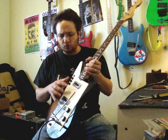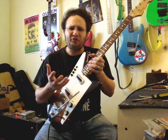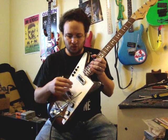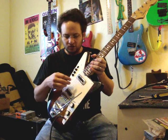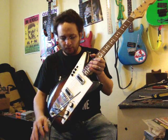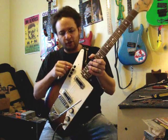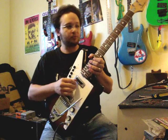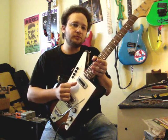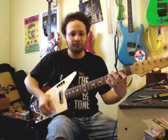2 single coil pickups that were originally wired to some high-pass filter that caused the bridge pickup to sound very out of phase with itself, very thin. Same thing with the neck pickup. So one of the things the customer wanted me to do was bypass that, which I did. So I basically bypassed the high-pass filter and wired the pickups directly to the switching. And in doing that, the pickups sound very full, very P90-ish. Okay, so you have the on-off switch here, neck pickup switch, bridge pickup switch, and then the combined switch for both. The pickups have a really, really cool punchy tone to them.